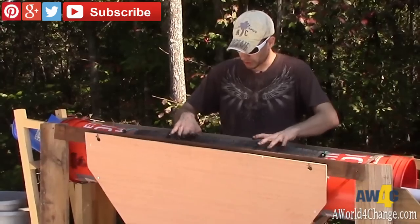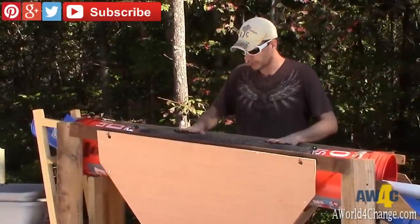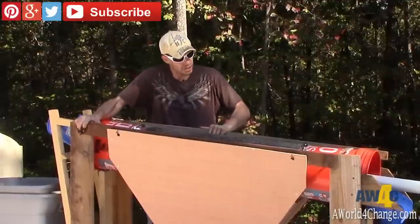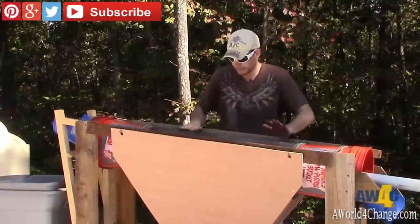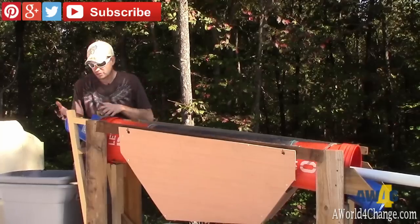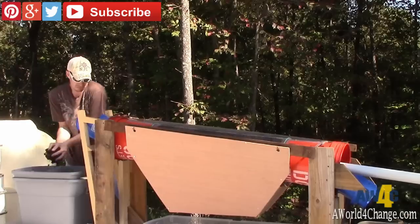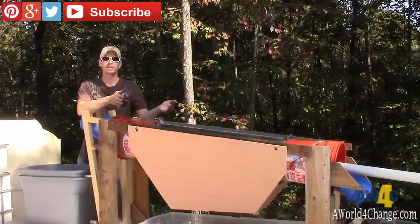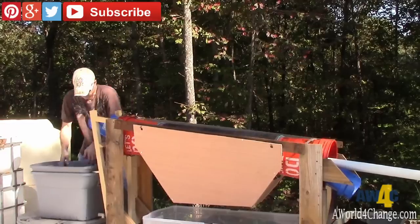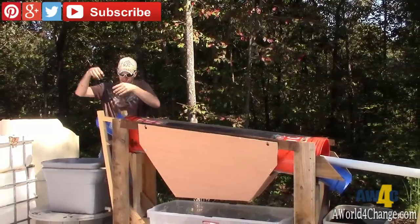So I think there are a couple of remedies. First of all, this thing gives a little bit, so if we put a caster across the top here that's slightly pushed down, it would make it dent — that's one remedy. Another remedy would be to take a motor with an offset weight, a vibrator, and just mount it on the frame so that it just shakes it lightly and vibrates it, kind of like a concrete vibrator. Secondly, I would like to build this chute out to be a little more effective. Sometimes I have challenges if I overfill it. If you're working by yourself, you want to be able to put a good amount in, walk to the other end and work it until it's completely gone, then come back and put more in. My suggestion would be to try to figure out a way to put a hopper on here that would feed in and not get stuck.